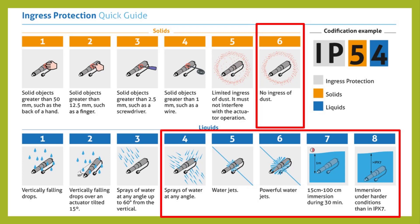We'll just stick with the IP ratings. At Freaklabs, for land deployments, we use generic off-the-shelf IP65-rated enclosures. Off-the-shelf is useful because the enclosures are readily available and affordable, and we can swap them out easily if they are destroyed.